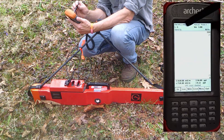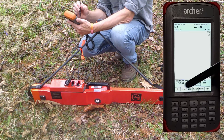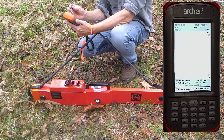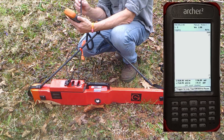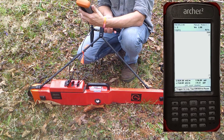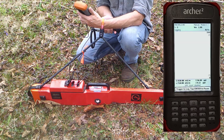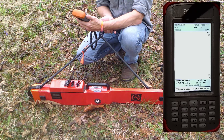It's telling you that it wants to start on line one at reading one. I'm going to hit go. I didn't actually take a reading when I hit go — what I did is I got ready to take a reading. Now the screen at the bottom says 'trigger to log, tap enter to pause.' When your data collector is hooked up to the extender arm like this, pressing this button will trigger taking a reading. I'm going to press it. The numbers change very quickly. Notice that it still says it's at line one, station one. It has now taken the reading at station one, so it will not advance to station two until I hit the button again.